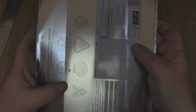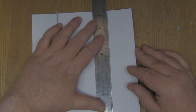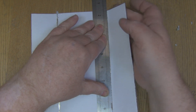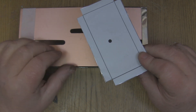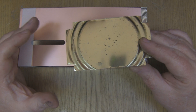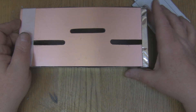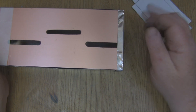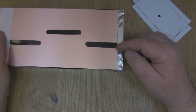On the back you can see I've scored it and made that indentation all the way through. All you need to do now is flip it over, put the ruler back up against that score line, apply a little bit of pressure, and just gently bend it up — you'll get a nice straight line all the way down that score. For the ends I had to get some different tin because there wasn't quite enough on the first piece to make all the components. A friend of mine saves me big baked-bean catering tins, so I used the ends of one of those. This is the first prototype and, as you'd expect with a prototype, I've already spotted I need to cut away some tin that's covering the slot slightly.